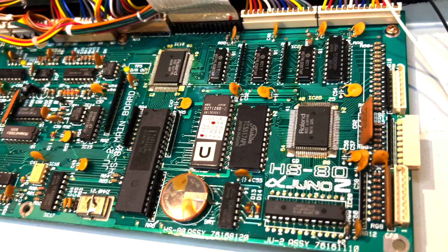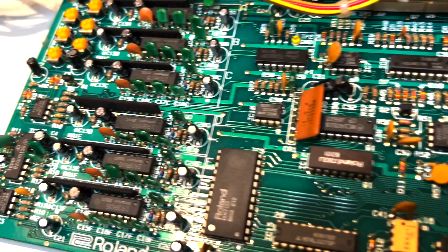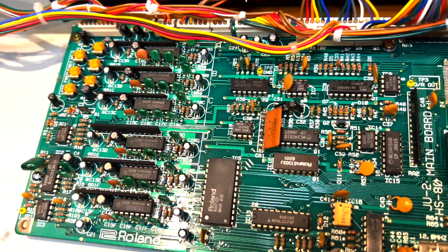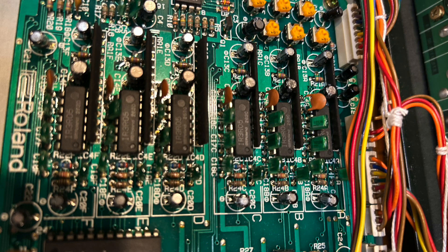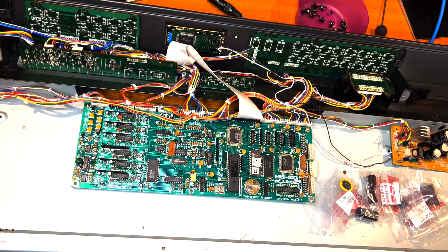The keyboard slides out — it's a bit tricky — but it actually rested underneath the motherboard. Here's the actual main board. You can see the Roland DCO chip there, the CPU, and the ROM with the U on it. There are the IR-3R05s — six of them. And there's the ROM right there. I have version 2.5, which is technically the latest and last ROM by Roland. You can see the battery as well — it looks pretty puffy, so obviously that's got to come out.